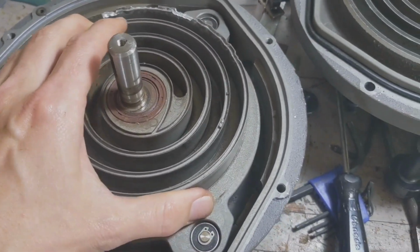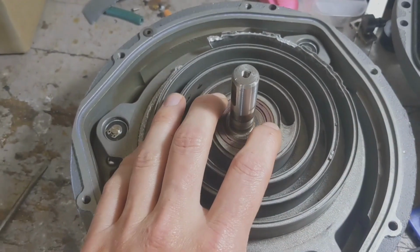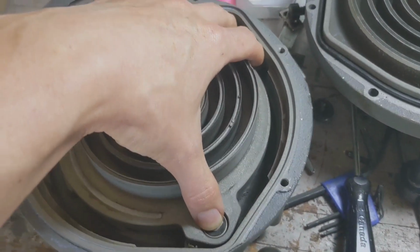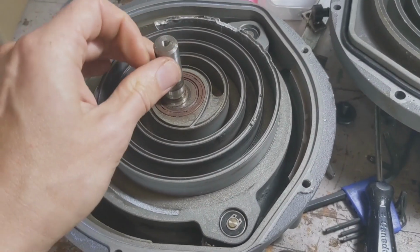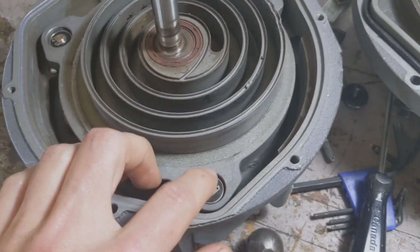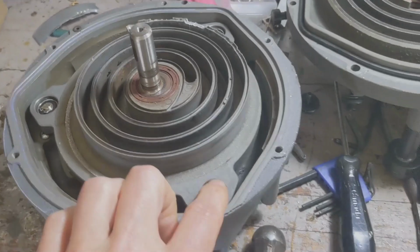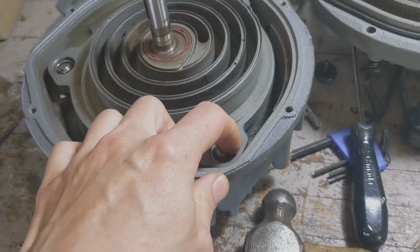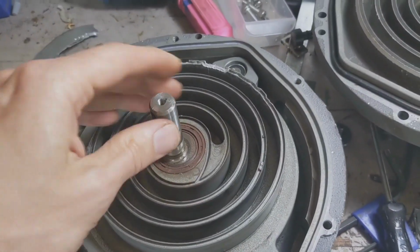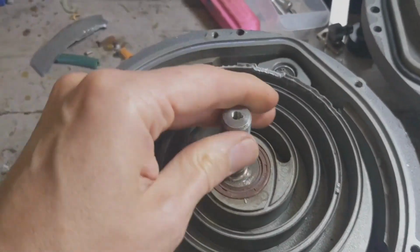So that's the consequence of only changing the tip seals and the shaft seals, which is the general maintenance you're supposed to do after 8,000 hours. And the bearings, which is another cost, are supposed to be done along with the shaft seals and everything, another 8,000 hours after that. The bearings that are used are high quality. The brand is NSK, made in Japan. They're a lot more expensive than generic bearings. So I'm going to suggest don't cheap out. Maybe in here you might be able to cheap out a little bit because that's totally contained. If something goes wrong, it'll just stop working.